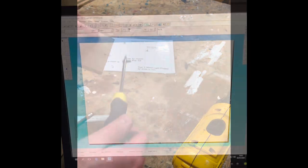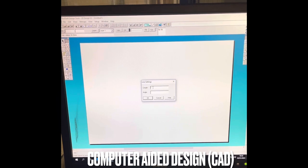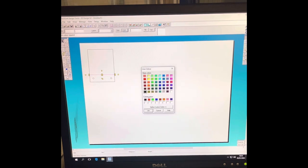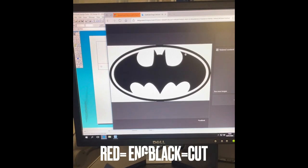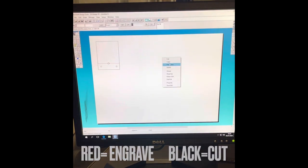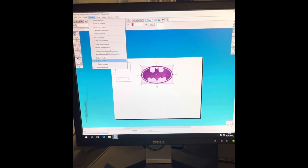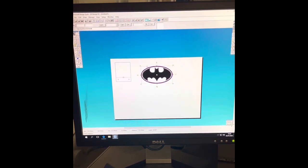We can then start to design our acrylic for the top using 2D Design, which is a CAD (computer aided design) package. We're going to use this to accurately draw out our design — using gridlock to draw the dots and the measuring tool so it's nice and accurate. We then need to place three holes: two for the screws to screw our acrylic on top and one hole in the middle for the LED to poke through. Using black lines for cut and red lines for engrave, you can create your design. If you want to find an image off the internet, copy and paste it, then use the bitmaps tool to contour that image and apply it to your acrylic.